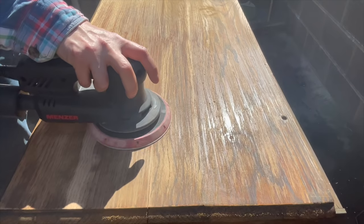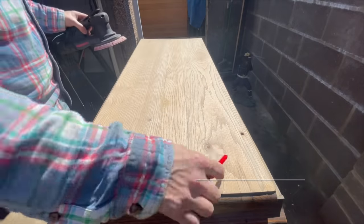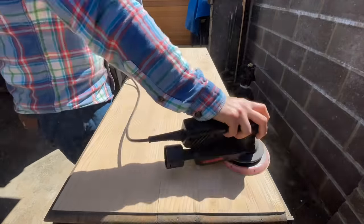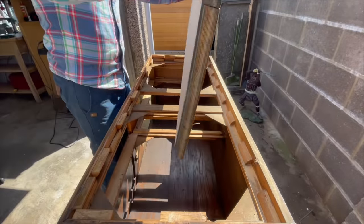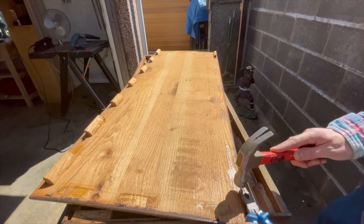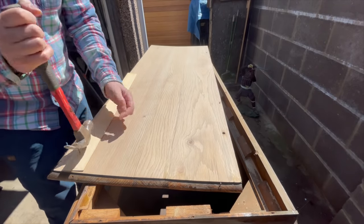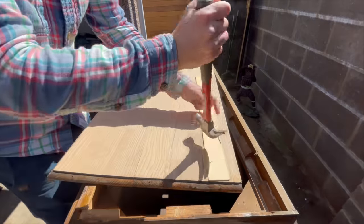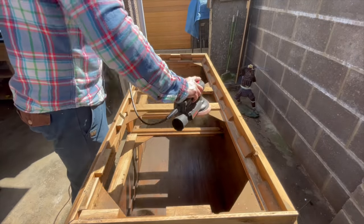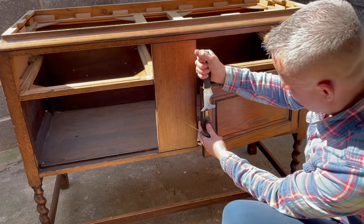As I was talking you could see me using my card scraper to remove the first layer of varnish, and then I went over it with my new sander — which is amazing, by the way. This is my first five-millimeter stroke sander and I'm totally in love with it because it just works so much quicker than my old one. I removed the top, removed the nails from it, and prepared the surface for re-gluing. Since the top was off I took advantage of that and cleaned up the inside. I also removed the hardware and put it aside for later.